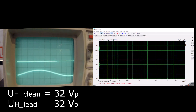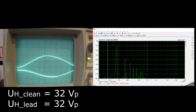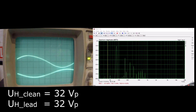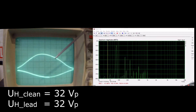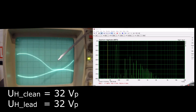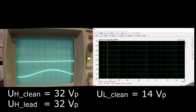Now in the lower power mode, starting with the clean channel. We're at 10 volts and already at 6% THD distortion — noticeably higher than the high power mode. Going further and we can see it's much more distorted. There's the clipping at top and bottom. It's at 14 volts peak, in clean on low power mode.